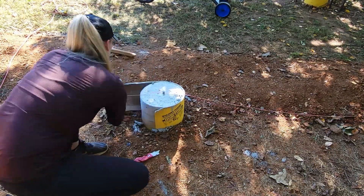Now it's time to work on the structural framing. If you have a taller deck, you would attach your posts, level, and cut to length. Because my deck is ground level, the beam set is put directly on the post base. My beam set consists of three 2x10s screwed together with 4-inch structural wood screws. I then attach the beam to the post base using 3½-inch nails — I invested in a palm nailer for this project and it was a lifesaver. Be sure to nail every hole on the brackets and square your beams before nailing. To finish the beams, I applied deck flashing tape to protect the wood substructure, since I'm using composite decking boards.